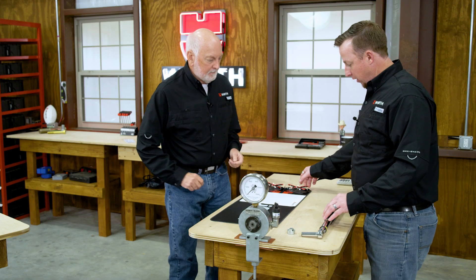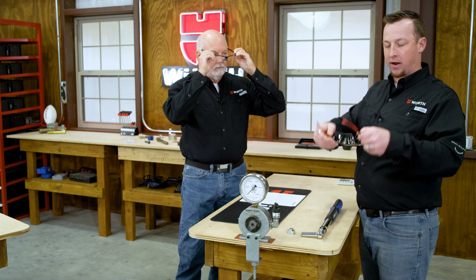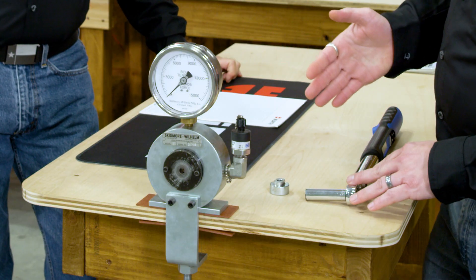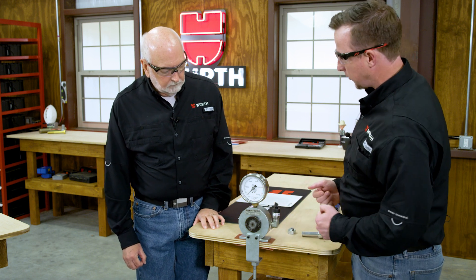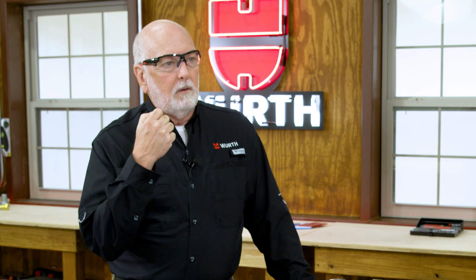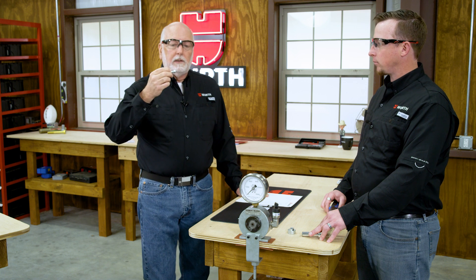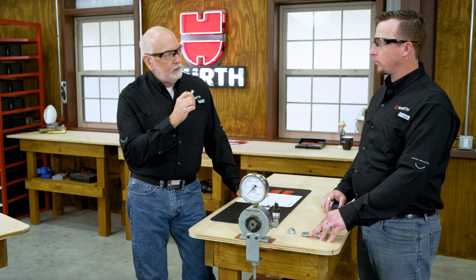The best way to explain this is with a demonstration. Just like any good experiment, we need proper personal protection equipment — safety glasses. What we have here is a load cell that tells us how much tension is in the bolt, shown in pounds force on this gauge. We use the torque wrench for torque and the load cell to measure the resulting load. I looked up the Industrial Fastener Institute catalog on torque: for a 5/16-18 by 2-1/2, grade 5 zinc-plated trivalent chromate, it specifies 249 inch-pounds of torque to accomplish 3,600 pounds of load.